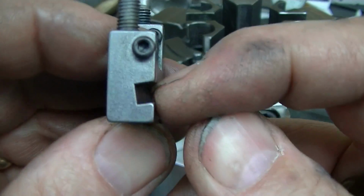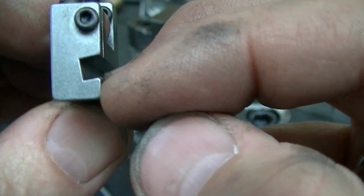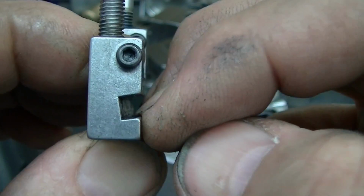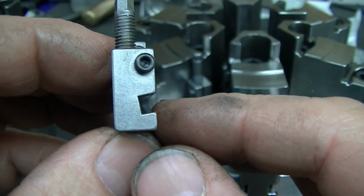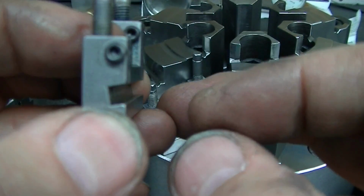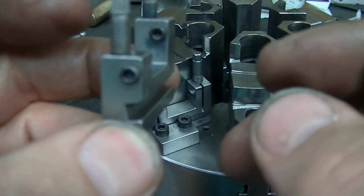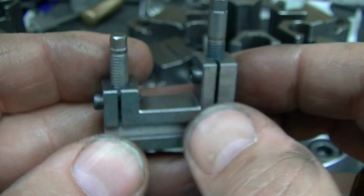Another feature is the 10 degrees I put in here just as a means for this to sit back tight against the clamp shoe that you'll see down here. Relatively simple way to have the part actually held. Yes, you can put these out and hold them and get it to clamp, and it could scoot in, but if you just gently hold these against the stop block, the clamp block, they clamp up nicely.